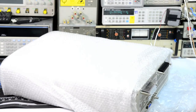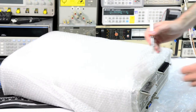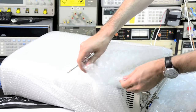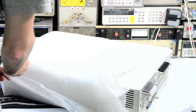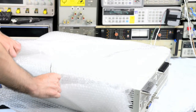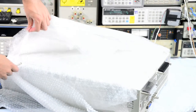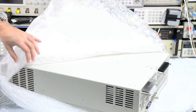So it's essentially a programmable isolated AC source for voltage ranges up to 300 volts that is very suitable for testing power supplies, various mains power instruments, doing the stress tests and stuff like that. Usually these are pretty expensive. Can cost multiple thousands of dollars even if they are broken. So this was kind of an unexpected acquisition this time, so we'll see how it goes and if it's actually working or if we do need to do some repairs.